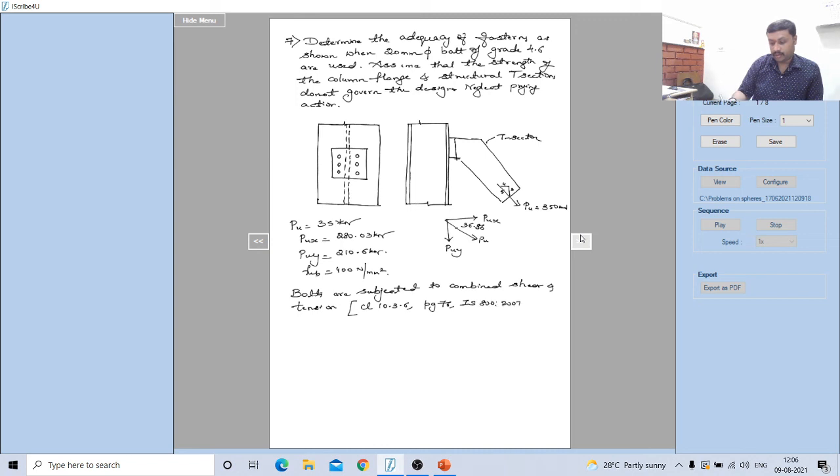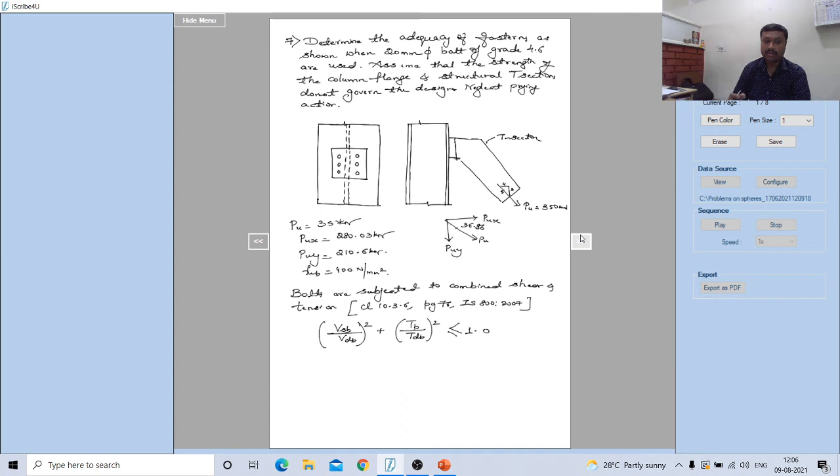We already discussed this formula in the first session. (VSB divided by VDB) whole square plus (TB divided by TDB) whole square should be lesser than or equal to 1. Okay, where VSB is the factored shear force acting on the bolt, VDB is the design shear capacity, TB is the factored tensile force acting on the bolt, and TDB is the design tension capacity of the bolt. It is given in clause 10.3.5. Okay, so VSB is